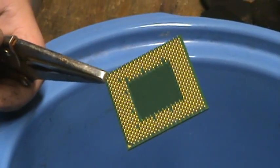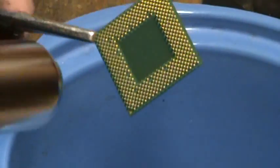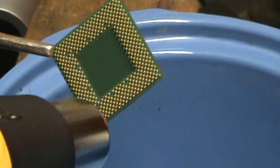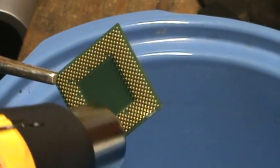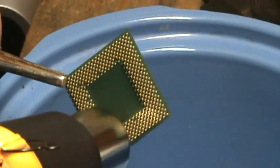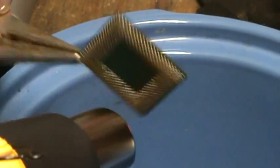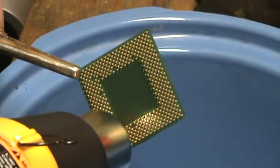And you're going to need something to catch them in. What you want to do is turn your heat gun on high and heat the front of it. It usually takes about 10-15 seconds to start to get soft. What you're doing is getting the solder soft, and then once the solder is almost melted, you just tap it on the side of the bowl and the pins will come flying out.